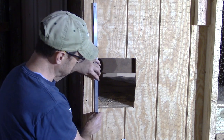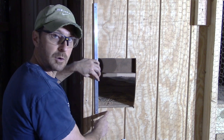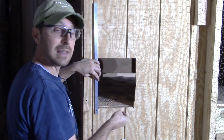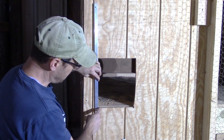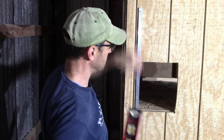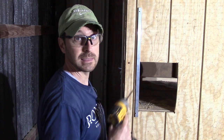It doesn't say specifically in the instructions, but this rail looks like it's mounted about an inch and a half below the opening of the door. I think that is to provide the door to come closed over the top of the exterior siding so that no creature can push on it or get claws on it and push it up. Although that actuator is really tough, I think that's a safety feature. So we're going to mount the bottom of the rail an inch and a half below the opening, check for level, and then mark it.